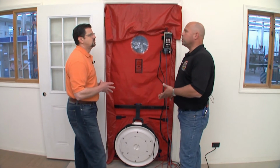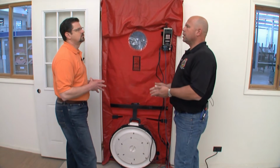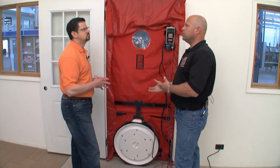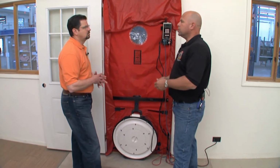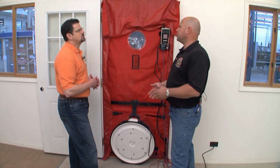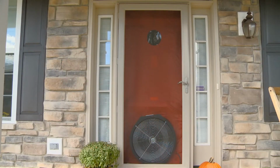Correct. The energy codes are getting more strict, and they're mandating that we test the facilities. Once we test, we do a simple calculation to tell us how much air is leaking out of or into the building, and we have to meet that in order to get the final approval to get occupancy. And it benefits the end user. That way they know they have a building that's really performing the way it was designed to be.